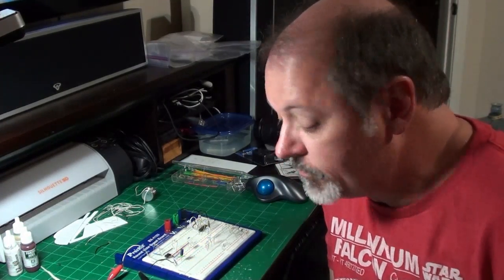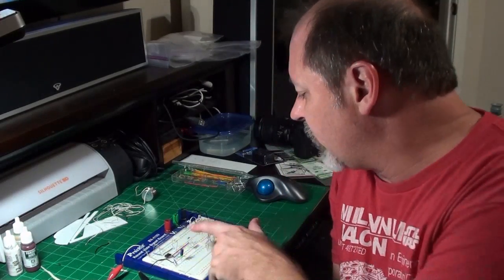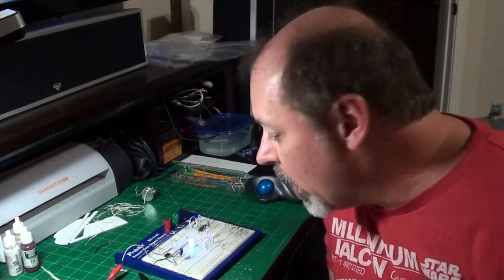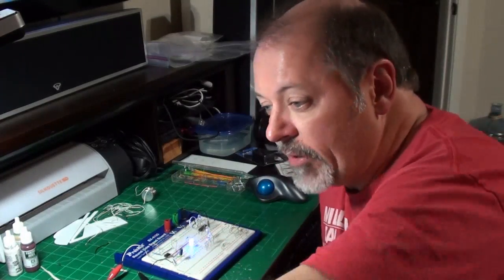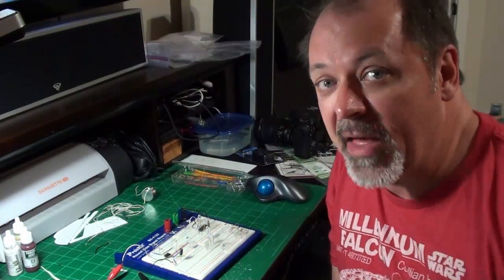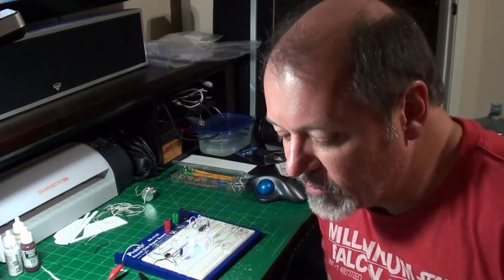Input voltage is 5 to 15 volts — anything in that range and this thing will work. I'm on 9 volts right now because I originally designed this circuit for 9 volts and I know that resistor is for 9 volts. The problem is output voltage corresponds with input voltage. So if I changed it to 5 volts, the LED won't even light up because that resistor will suck too much voltage out of the system. If I change it to 15 volts, I'm going to fry that LED. With the 4060, I can change the voltage all day long and the output is constant for LEDs — it's optimized for LEDs.